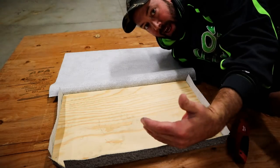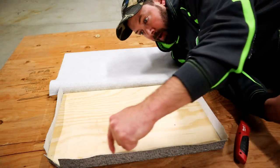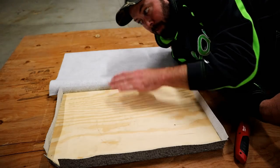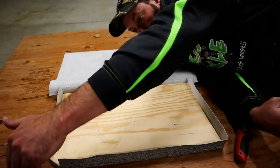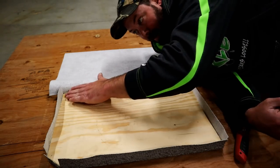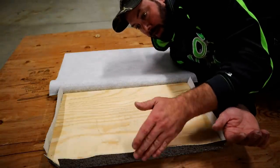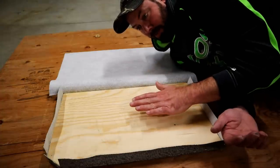All the sides and tabs are glued down and stapled down. We just want to run the edge of the knife along all of these sides that are sticking up and make this nice and clean. Next step is to flip this over, get this filled up with glue, put a little weight on it, and then the last step is to do the other sheet — just without the tabs, cutting out the corners, then we'll have flaps that get glued down, stapled in, and cut off. On that other side you have to be really careful because now you're running the knife edge along the finished product — you don't want to go cutting into the nicely glued down vinyl on the other side.